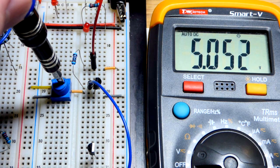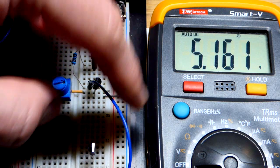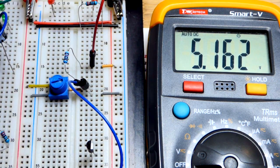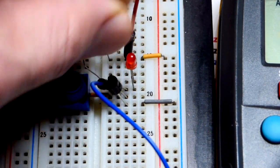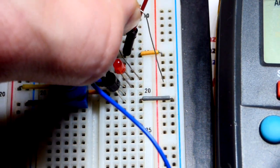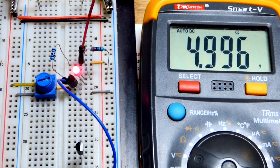We're going to go up to about 5 volts. It looks a little better when it's 5.1 rather than 4.9. Now we'll grab the LED as our load. The cathode goes to the emitter of the PNP bipolar junction transistor — that's the short lead. Long lead, the anode, goes up one row. Then we grab a 220 ohm resistor and put that to the positive rail. Now you can see the LED is lit up, and it's still holding about 5 volts.